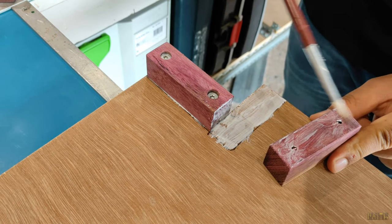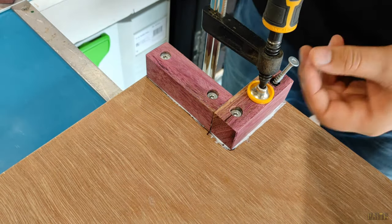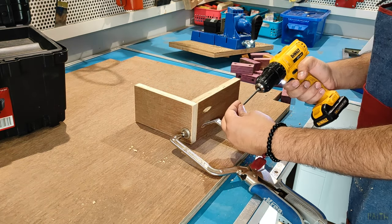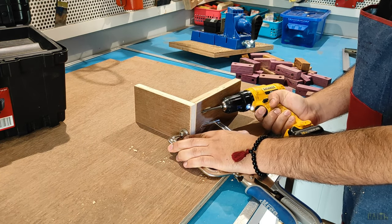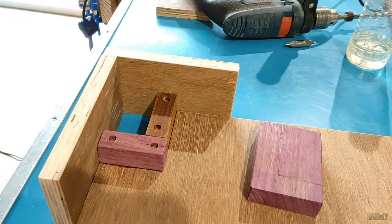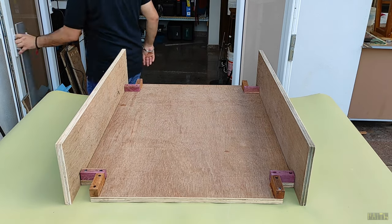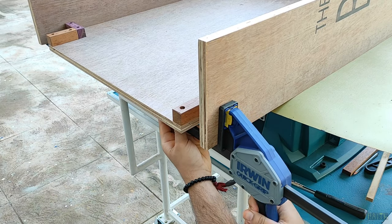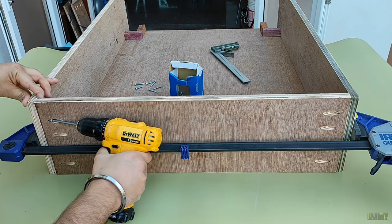Then I applied wooden glue and secured the pieces in place with the help of a clamp, and finally secured the blocks with the screws. To get the right end of plane, you can make a temporary arrangement by joining two small pieces of plywood together with pocket hole screws — this helped to place the wheel housing blocks more accurately in their positions. I carefully aligned the plywood sections, used quick grip clamps to hold them together, and permanently secured them with screws in the pocket holes drilled previously.